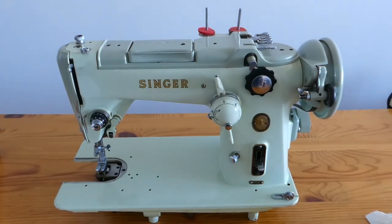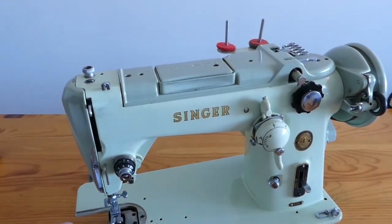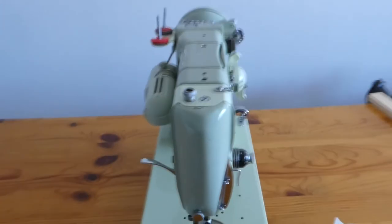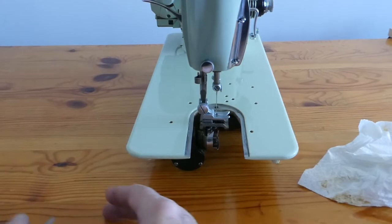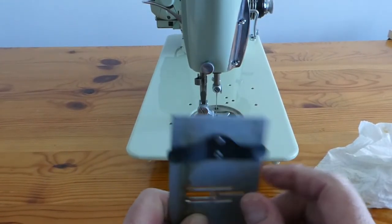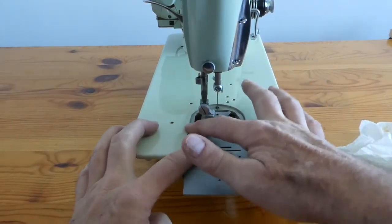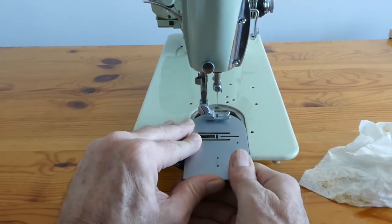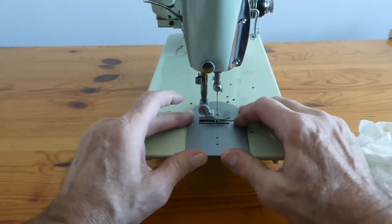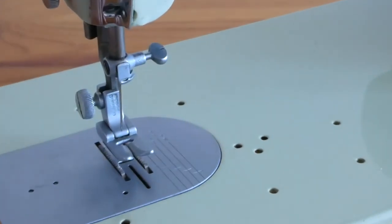That's all I have for us today. I am going to show you how I put this back in. The most important thing we have to pay attention to: we see this spring with the two screws, and we see that the top of the plate floats in that indentation. Then we raise it. We have to make sure we get both ends of the spring or clip — there, it's in now. We'll push it in and push it down. And there we have it — it is flush and it's ready to go again.